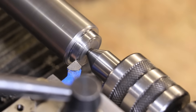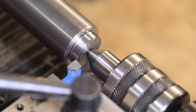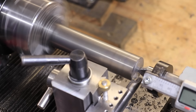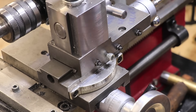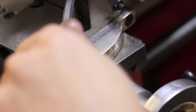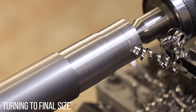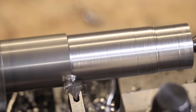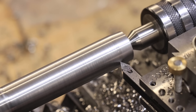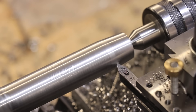I'll then machine in a small step down at one end. With that done, I'll flip it and clean up the other end. I'll then set up the top slide to cut a five degree taper — and it really doesn't have to be all that accurate. I'll start cutting the taper using the top slide. I don't have to cut all that much, but given that this is a really small top slide with a really small travel, this is probably all I could do with the top slide.